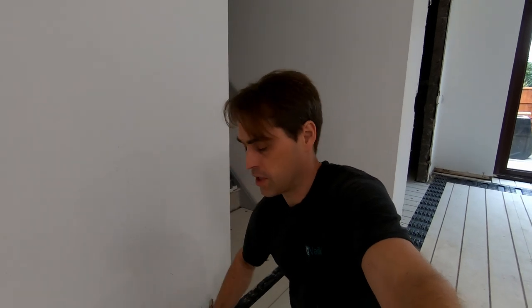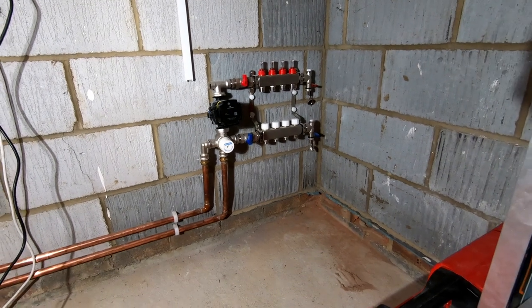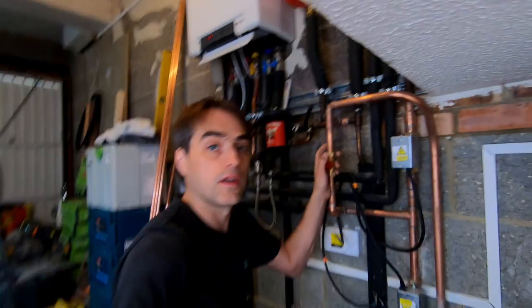We've got all the panels down for underfloor heating. We drill through the wall to get to the manifold with the pipework, then slip those pipes through the wall all the way to the manifold. I will have to route my own channels in the middle of the room, because otherwise I'd have massive off-cuts of pipework. The manifold is just behind that wall in the garage next to the boiler.